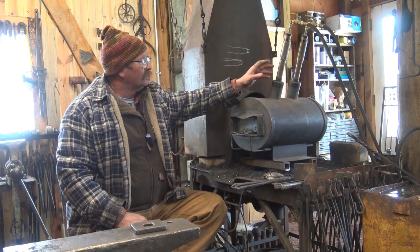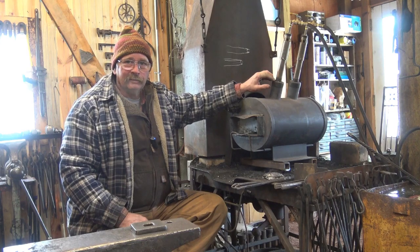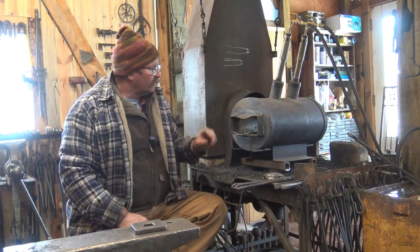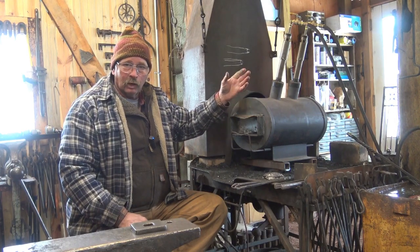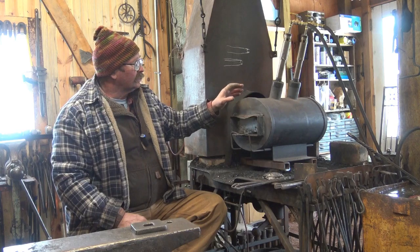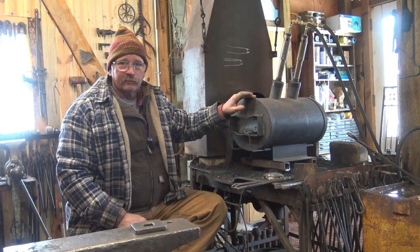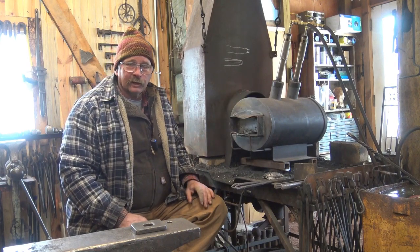The other type of burner uses a lower pressure generally and has a blown air stream. Those used to not be that great, but now they're really coming along as people design better ones. Ribbon burner forges have a ceramic block with lots of little holes in it — a relatively low pressure gas with a blower gives a very even heat and can be used for forge welding if designed and insulated properly. Those are some outstanding forges, and my next gas forge will almost certainly be a ribbon burner forge.